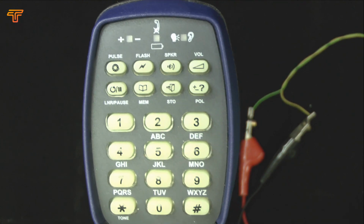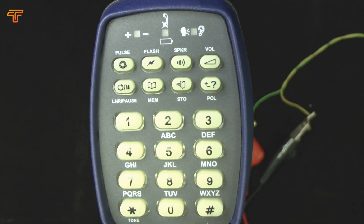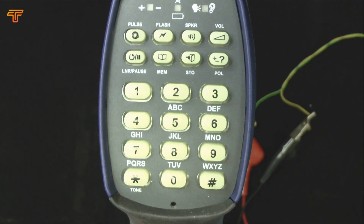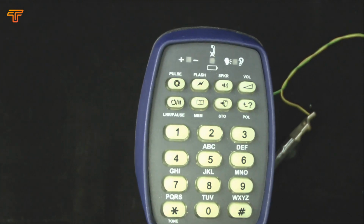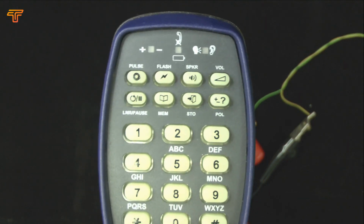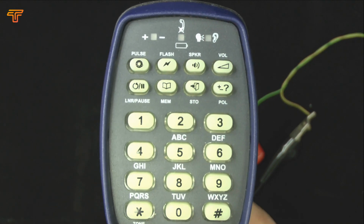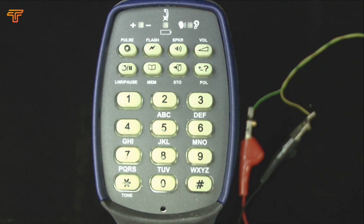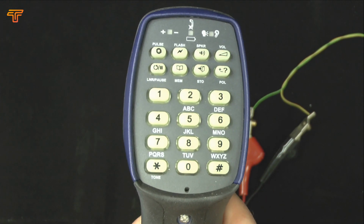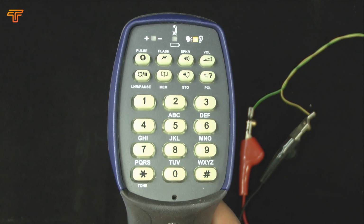Now I'm back in monitor mode, and if I increase the voltage on our test line here to over 120 volts, then we're into what's called the high voltage protection regime. So 120 volts is often found on ISDN circuits, pair gain circuits and the like. Probably less common these days, but if you do find a line with this on it, you will hear this alarm. That longer, lower pitch beep cannot be overridden because that probably would cause damage to the unit.